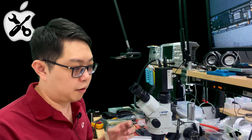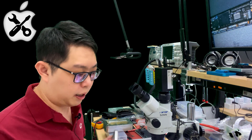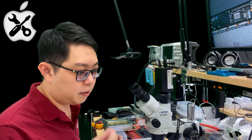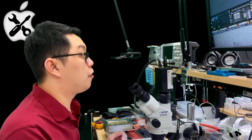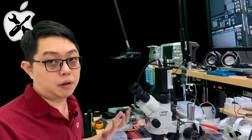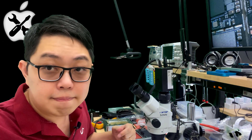Don't just look at it, see a little crack, and give up. Our job is to be more responsible as a technician — try not to miss any small details, and don't give up that easily. In this case I already did that, and it is still not readable. I already tried soldering on a known good EEPROM and it's readable, so we already confirmed the EEPROM is dead. That's it.